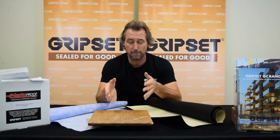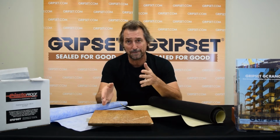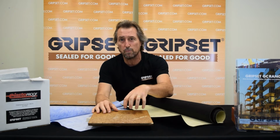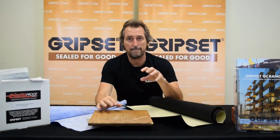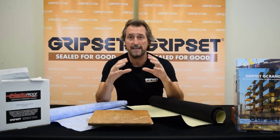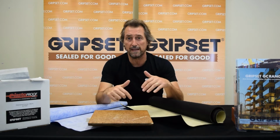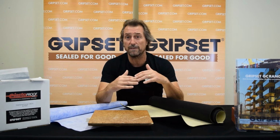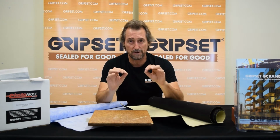Get this right, because the important piece is that, and this is imperative, right? Not just about important, it is vitally important that we understand this. Yellow tongue and particle board flooring, it doesn't always have to absorb water for it to move. It will find its way into a movement factor just from the thermal changes that happen within the building substrate or within the construction. And what that does, it will compromise the finish on top. When you've just nailed timber flooring down like you would in a dry area, then its fixing strength is a lot different than when it's screwed and glued down. Very important. So get that piece spot on first.